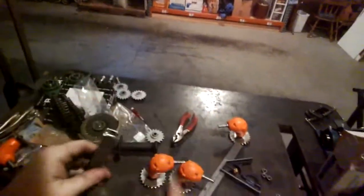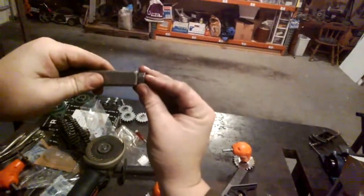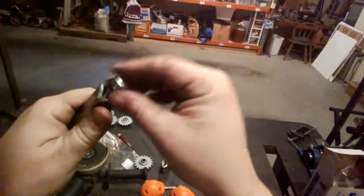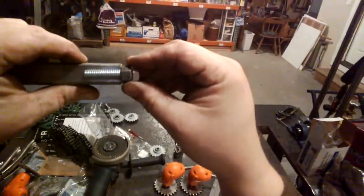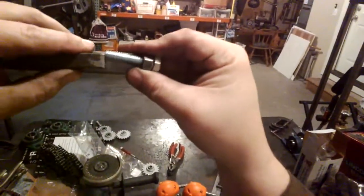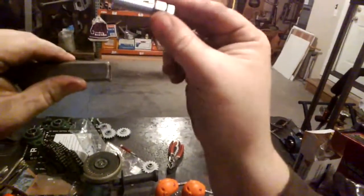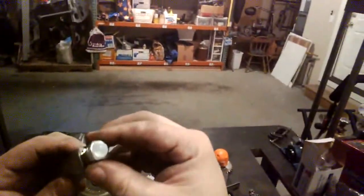It's time to start welding the nuts on top of here. Again, plain steel nuts made for welding, just right on top. What I'm going to do is leave it threaded on one of the screws here so that I can make sure it'll guarantee at least well enough alignment that this can screw all the way in. Which is really all I care about, because all this is doing is screwing in and pushing on this half-inch mandrel that'll be inside. So if it's a little bit out of alignment, I don't really care as long as I can screw it all the way up to that point. With this on there, I know it'll work.